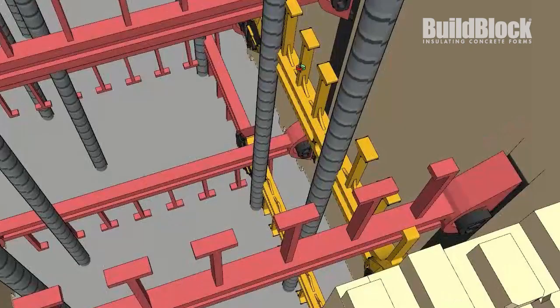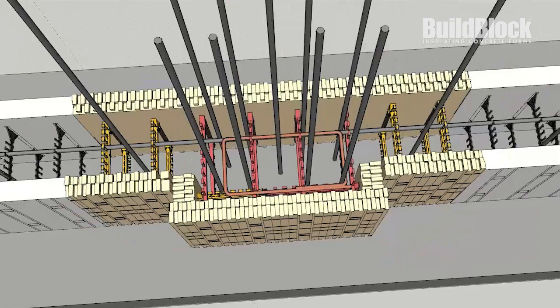Our 24-inch piece that we shortened should fit snugly underneath the 12-inch webs. We placed our horizontal rebar in the tension side of the wall — it will alternate placement each course. We also placed a box stirrup, which will line up with the horizontal rebar each course and alternate diagonally.